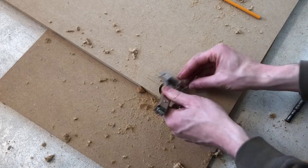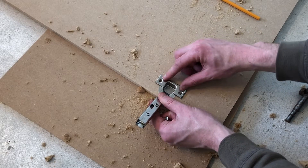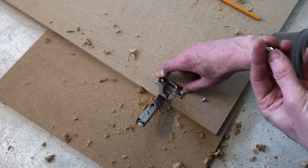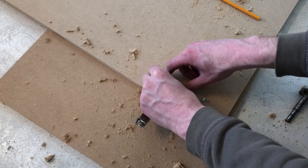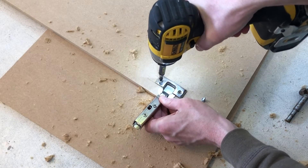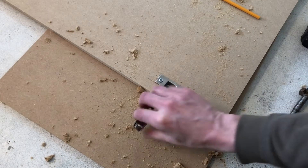The next thing you do is place your hinge in the slot. As you can see, I screwed up here - I had to remeasure. We all do it. The way you can ensure it's straight is by one, ensuring the pilot holes line up, and two, ensuring that the edge of the hinge lines over this line here. Once you've got that about right, you can go in with your screws. These ones are pan head, I think four by 16 mil, and these seem to suit this application quite well. I'd recommend not tightening it the full way just to make sure you get it straight, then go the full way when you know you've got it straight.